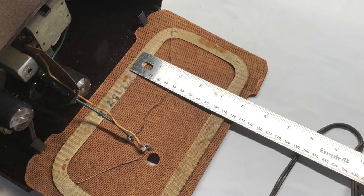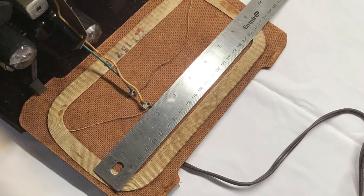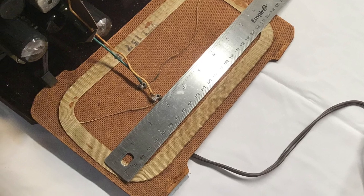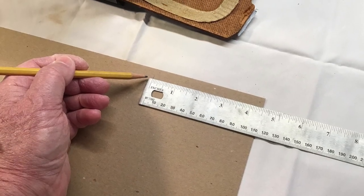It's nothing more really than an antenna coil, and the inductance of course is most important. It forms an LC circuit when coupled back to the tuning condenser or tuning capacitor.